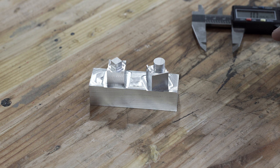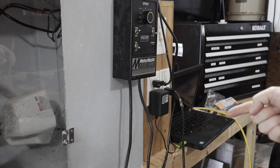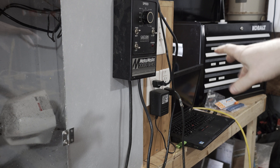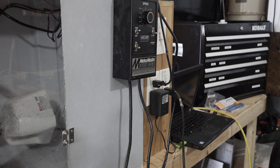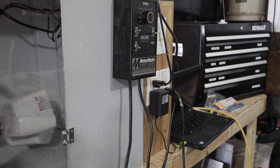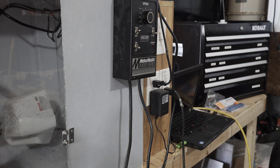I'll take you back over to the mill and talk about some of the things on it and stuff that needs improvement. Obviously there were a few hiccups getting going, and I suspect I'll have a number more in the future. Here's the setup. I want to give you a quick rundown of the enclosure and show you some of the components. Over here is the laptop that's running the shindig. This wooden box right here is all the control electronics — inside it there's a smooth stepper for motion control and three geckos, a power supply, a fan — all the stuff that makes the CNC a CNC.